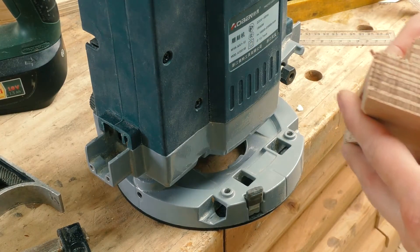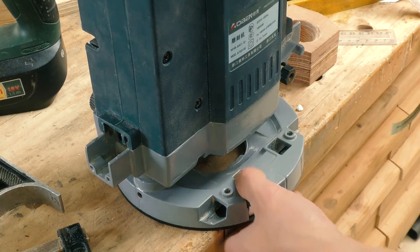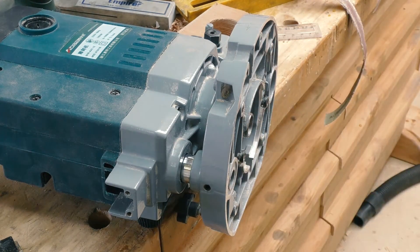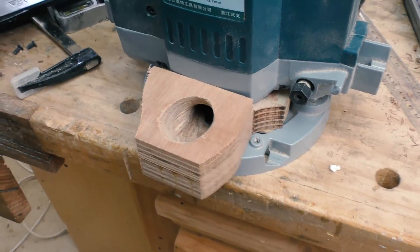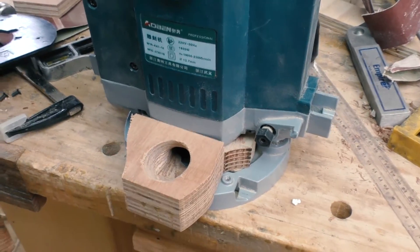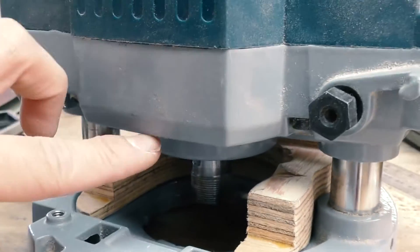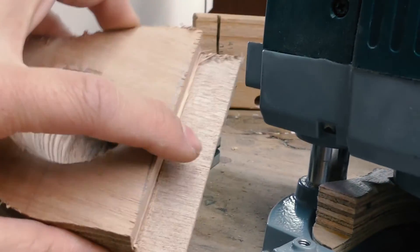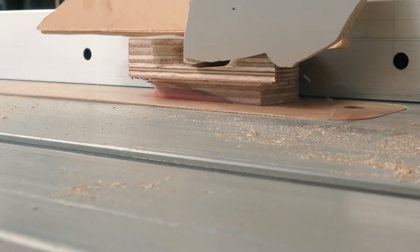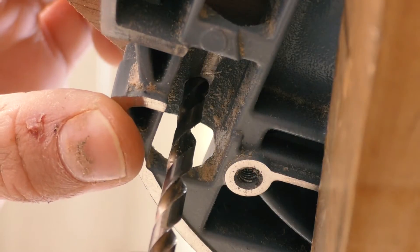To make shaping this piece a little easier, I'm going to take out this pin right here so that I only have these two extrusions to worry about. I actually only have one extrusion to worry about because I already made a cutout for the other one, and I'll use that for securing this piece down. I can see I need to cut away more material here — there's a gap, and since there's a big chamfer I don't want to go full depth or I might break out the other side. I'm using my chisels to create the corresponding chamfer, and then using a drill bit to mark out the mounting hole.